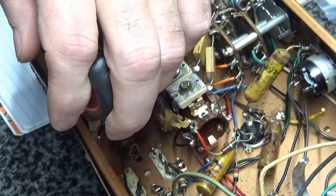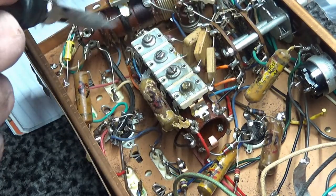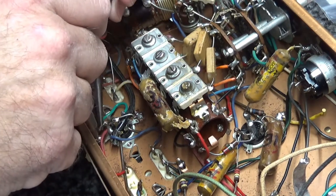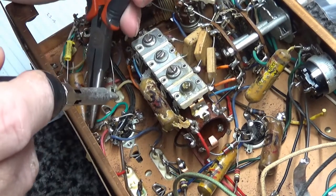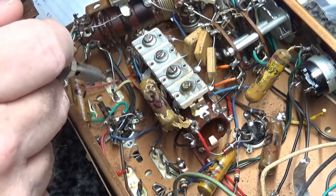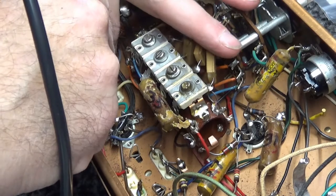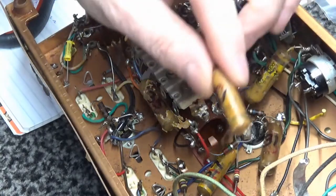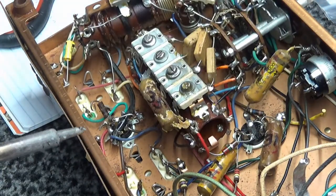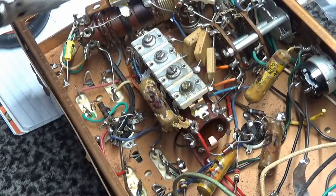These two wires are dangerously close. We don't want to mess up. I don't want to brand myself either like I'm about to. Move them out of the way a little bit. This is where I need my precision pliers. But I think we can get it. Let's see now. Get the resistor out of the way. Now we can go finish this up. One capacitor. Where's the camera? Again, that's a 0.01 at 400. Now to get it off the other side. The other side of it goes here.